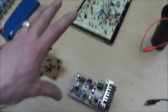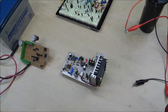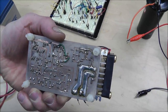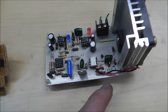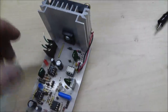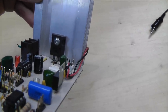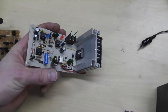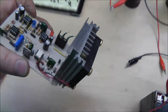I'm going to go ahead and post the circuit along with the printed circuit board layout as it is. It works pretty well. I'm missing one component — I accidentally burned up one of my 12-volt voltage regulators, so I just bypassed it. The chip doesn't really care, but it's better to be stable. It still functions. I'm currently using an IRFP260, though originally I used an IRFP460 — as long as it's an N-channel MOSFET, it will work for this circuit. I've got a small fan mounted on there for cooling, even though it doesn't get hot.